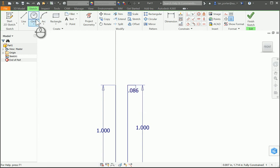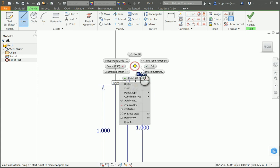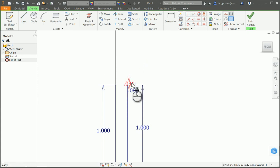I'm going to use my line tool and go back to the end of that 0.086 line, finding my green dot, and I'm going to draw a line straight up. There is a little flat face on the top of this cap and that distance is 0.031. Right-click OK. I'm gonna move my dimension here just to clear things up.